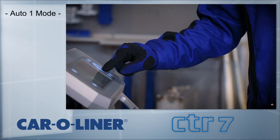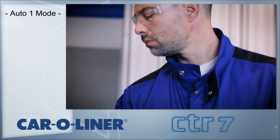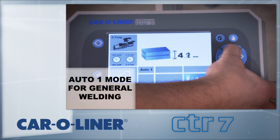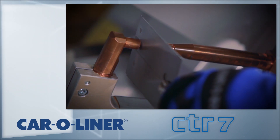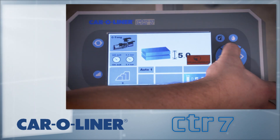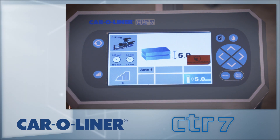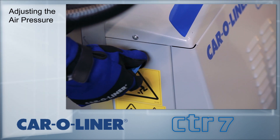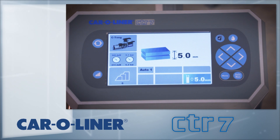Several modes for welding are available. The Auto-1 option allows for welding as determined by the total thickness. By pressing the up or down arrow, the technician sets the combined thickness of all the layers and the welder will automatically set the parameters needed to make the weld. When welding material thicker than 5 millimeters, the welder will provide notification that the air pressure must be adjusted. Air pressure readings are displayed in the lower left corner of the screen. The top set of numbers displays the required pressure while the bottom numbers indicate the measured values. Turn the air pressure regulator up or down to adjust. When you are within range of the desired value, the message will disappear.